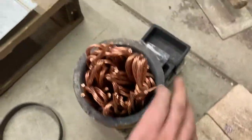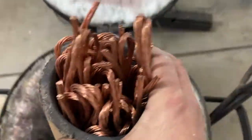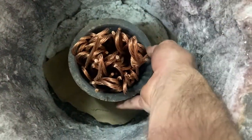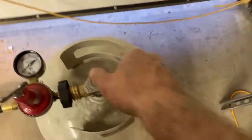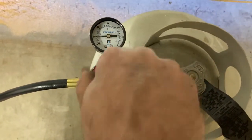Oh yeah, the cardboard. That was a BigStackD trick. If you don't do that, the crucible sticks to the fire brick, and then when you pull it out, the brick's stuck to the bottom, and it's way heavier and annoying, and it can break the crucible, and it's just all around sketchy. So you want to have that cardboard in there so that there's a carbon layer between the brick and the crucible, and then you're good to go.